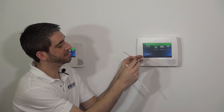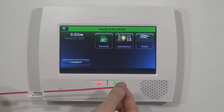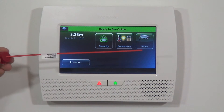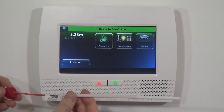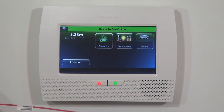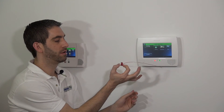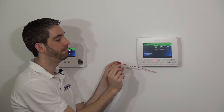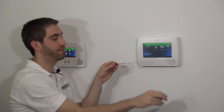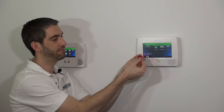This little red plastic piece snaps shut to keep the battery in place. And then this red piece is actually the wireless antenna for the transmitter. They give you this little straw so that when you install it — you take the sticker off — it protects the antenna and covers the entire body. The key to installing one of these is that while the depth you need to drill for the sensor is only this deep, you also have to have a cavity deep and big enough so that you can slide the antenna through. You do not want to install this so the antenna is bunched up, because that's going to greatly reduce your range.